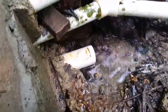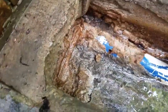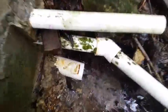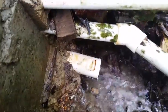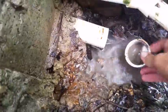And then you can see there that the drain pipe is just letting the spring water out right now, because I was cleaning it. Every now and again you have to wash it out because silt will build up. You could use a filter, but the problem with a filter is it'll clog. So I don't. I just basically take the end cap off and let it drain out and hose it out. I've got fairly good gravity pressure from the tower I built. Let's see if I can wash this cap out here before I put it back on.